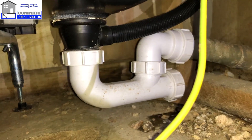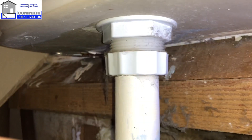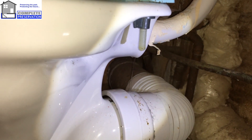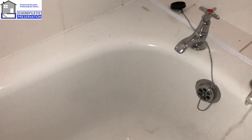Typical as well, the waste is not supported and you can just see the water's pooling up down the bottom there as well. I'll flush the toilet - that is leaking on there, we can just about make that out. And it's also running - you can just see it there, just running there. You can see there's a lot of water there. That is six leaks - six leaks in this just small little area here.